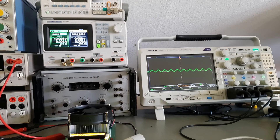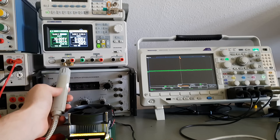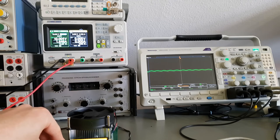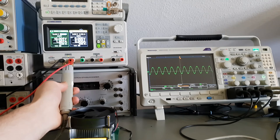What about the normal everyday applications? Well, it's precise, powerful, and quiet when it can be — quiet both in the cooling fan and the output ripple and noise department. Their spectacular noise specification of less than one millivolt RMS is verifiable and true even under load. It applies to all three channels and it is what you'd expect in a good linear power supply.